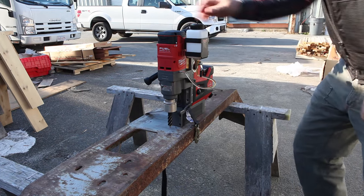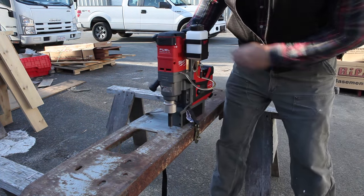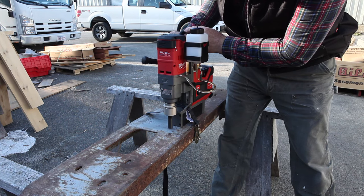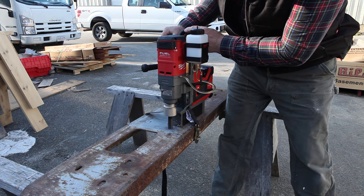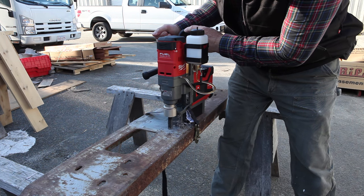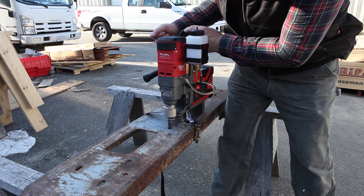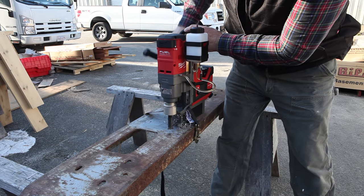It's a good time to check the motor speed — 400 RPM is right for these cutters. This cut is for a three-quarter inch hole. It doesn't take much pressure on the feed handle. When it produces curls like this, the feed rate is right.